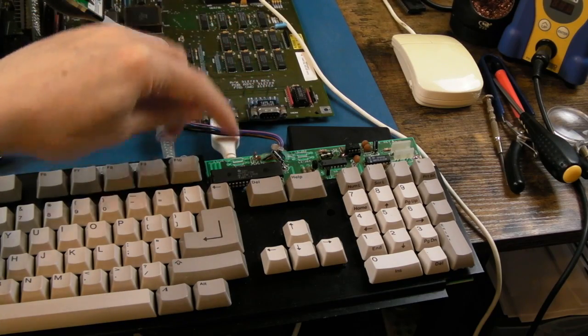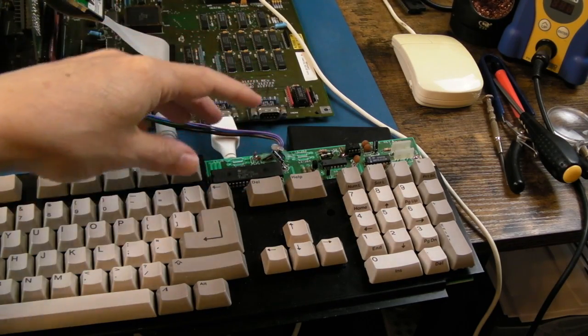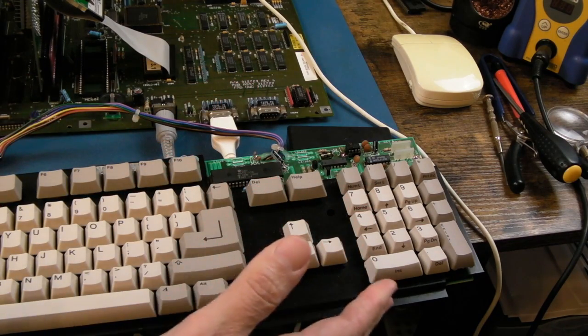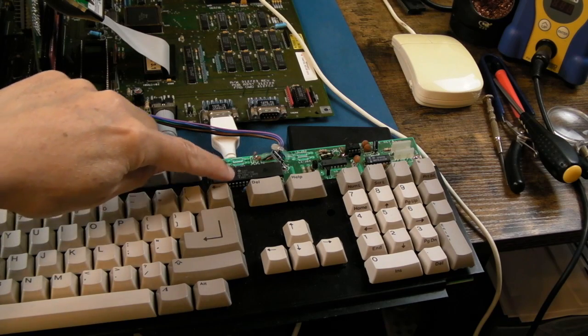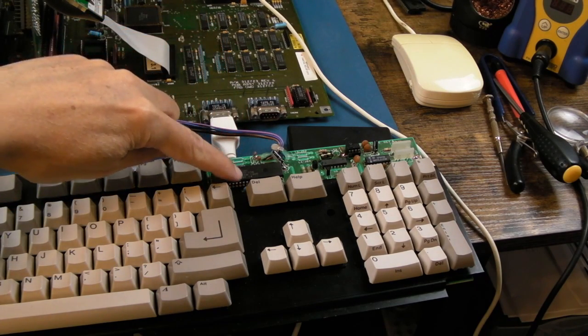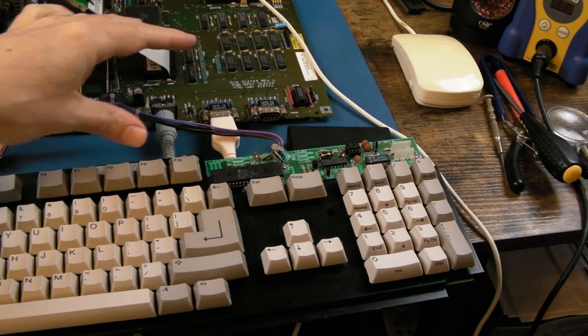All of those things obviously have an effect. And capacitance, that's the other thing. These things change. When something's been running for 5-10 minutes, it's warm, those things change, yeah? So the characteristics, the way that this is going to behave and the way the oscillation circuit in there is behaving changes over a period of time.